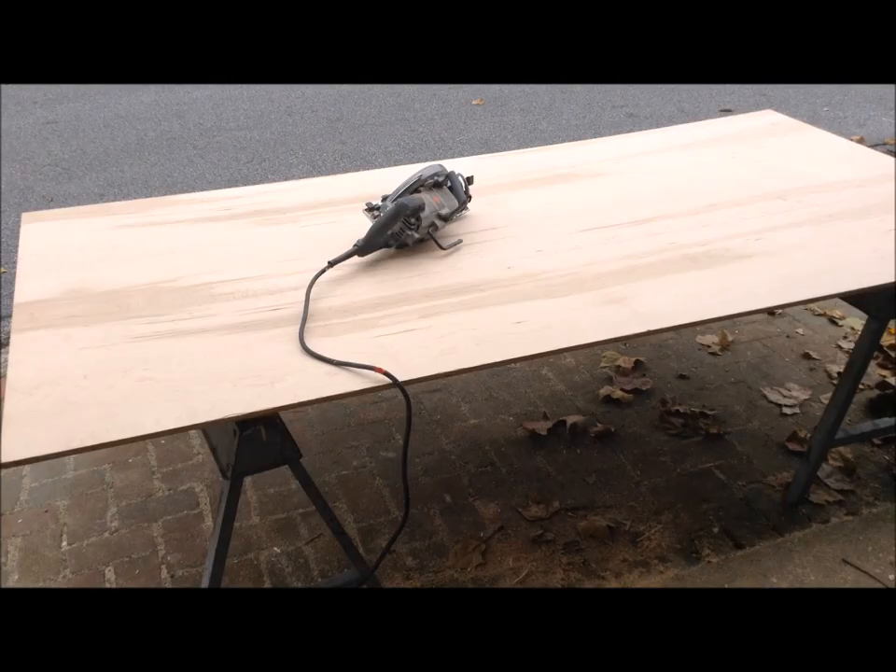The bottom of this box is going to be half inch plywood. You could probably get away with something thinner, like quarter inch or even an eighth inch masonite, but since this is going to be cantilevered off the wall — it fits in a nook, anchored to two walls and the entire back with no legs — that's why I opted for the thicker bottom piece, just to give it a little more structure. It's going to be 30 inches wide, so I'm cutting it at 31 to give me breathing room and to trim it flush once everything's done.